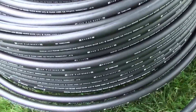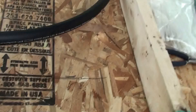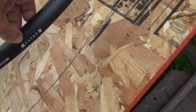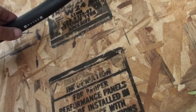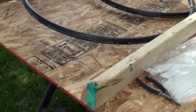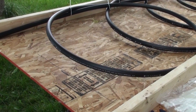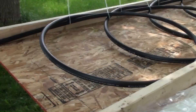There are numbers on here every two feet. This is 652 feet right here, and there you have 662. So if you know you need 75 feet out, you can just go find a number and that's your 75 feet — you don't have to drag your tubing out and measure it. You can if you want, if you don't feel safe doing it with the numbers, but I don't see why you couldn't do it just with the numbers.